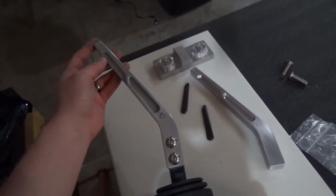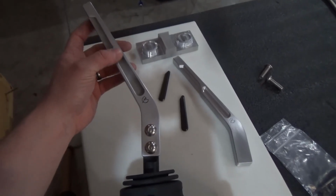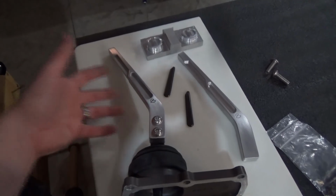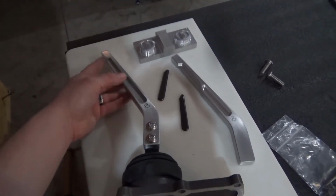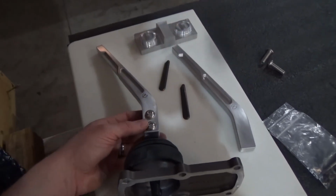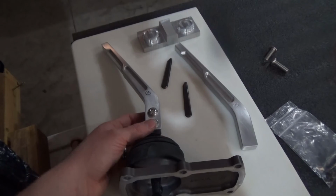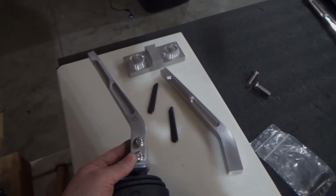So that's that fixture plate. That's what those engravings were for. So I'll be able to do 3 bars, pre-drill bars at a time, which I'll probably just pre-drill a bunch of them, and then I can do 4 handles at a time on that fixture plate, and that saves a lot of time from doing all those tool changes, because the tool changes is what takes time.